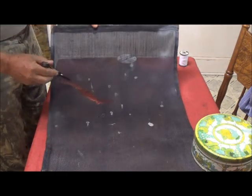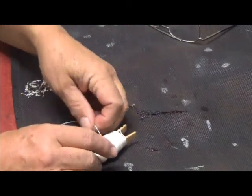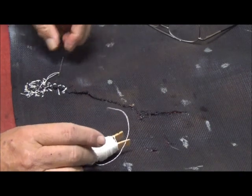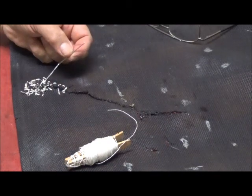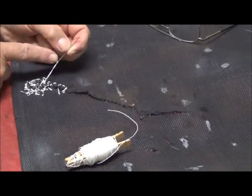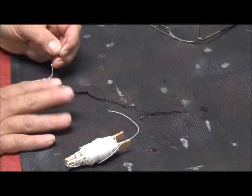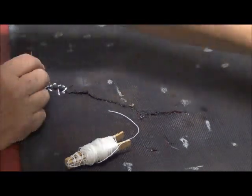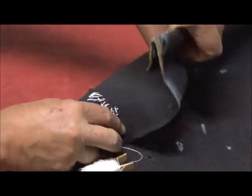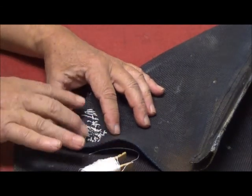The first thing I'm going to do is catch up these edges back and forth. Then I'm going to sew in the nylon reinforcing strap. I located some bow fishing line I'd salvaged — this is 50 or 80 pound braided bow fishing line. I also had a large needle in a kit I bought years ago that had an assortment of needles. This one is a darning needle — it has a particularly large eye and a sort of bluntish point, just fine for working this material, which has coarse pores. You can see what I'm doing here on the back side — I've run the line both ways to crosshatch it and catch up things both top and bottom and from side to side.